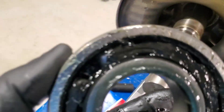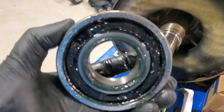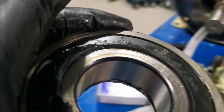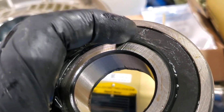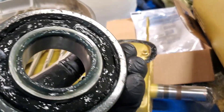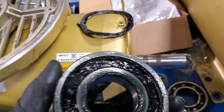Boom — bang, off! You can see the nice bright blue and how it's black — that's burnt. This was a 2RS bearing, which is fine to use in a motor. They took one seal out. I normally don't like RS rubber-sealed bearings in motors because they do generate heat from friction off the lip. It may have been a contributing factor to the over-greasing, but the back chamber was packed solid, so I kind of doubt it.